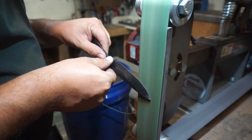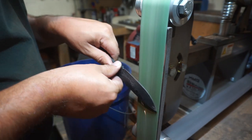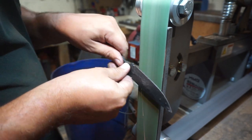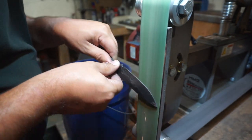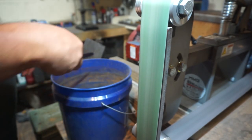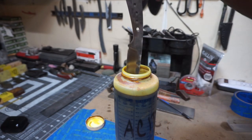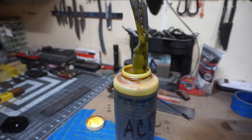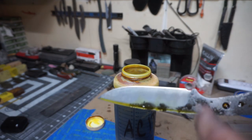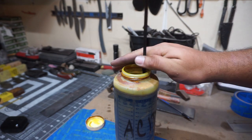We're going to clean up the blade at this point. I've already tempered the knife — two hours at 375 degrees, just one temper cycle for that full two-hour time. Then we went ahead and cleaned it up using a 100-grit belt, then a 200-grit belt, and then the medium Scotch-Brite belt to get the finish. Then we put it into the acid, which is warmed up to about 80 degrees — you want it warm, not just room temperature. You can see a little bit of the line between the two different metals, but you'll get to see the full effect in the outro.